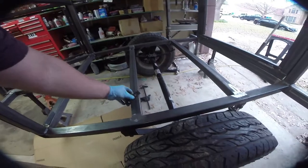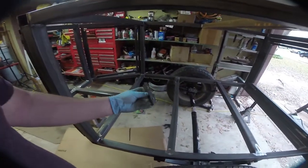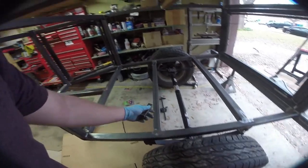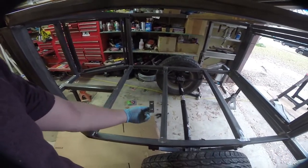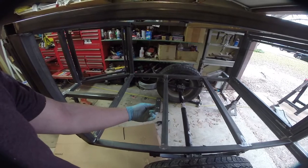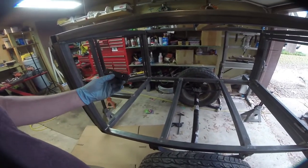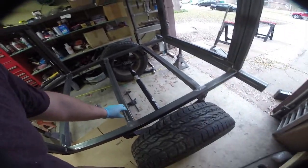And what I did was I built these. These are just little 1-inch angle iron brackets. And we're gonna riv nut the bottom of this frame so that this basically bolts in like this. And then we're gonna weld the structure to it. That way our whole underbelly tank situation is removable with 8 bolts anytime we need them.